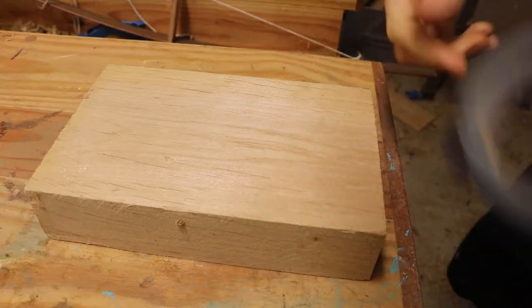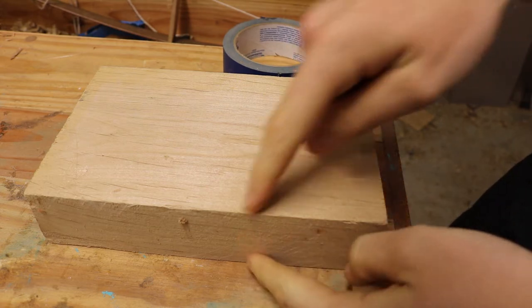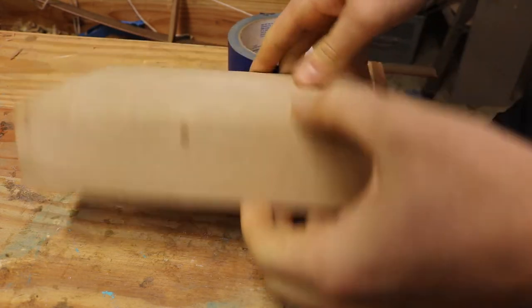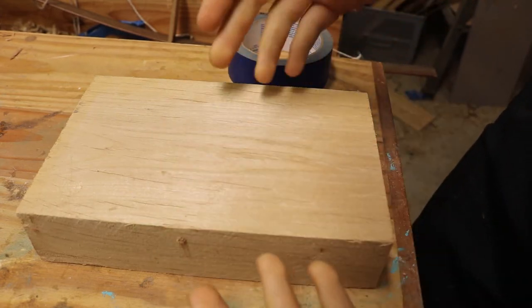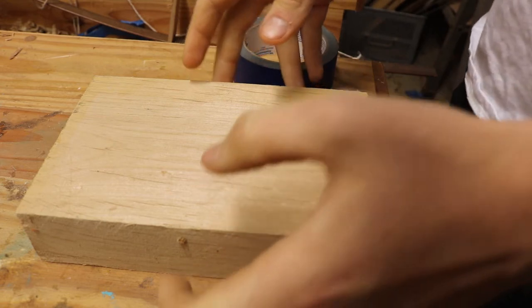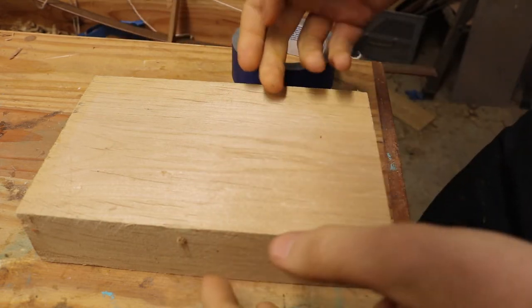So I wanna start out by just tracing the shape of my bowl in this. This is gonna be the middle piece, and this thickness right here is what determines how thick it is. It's about 2.5 inches, it's pretty large. It's just the thickest piece of cypress that I have. Obviously you can glue up more pieces and that would probably be pretty neat, and you could get a lot thicker vase. There are some limitations of the scroll saw.